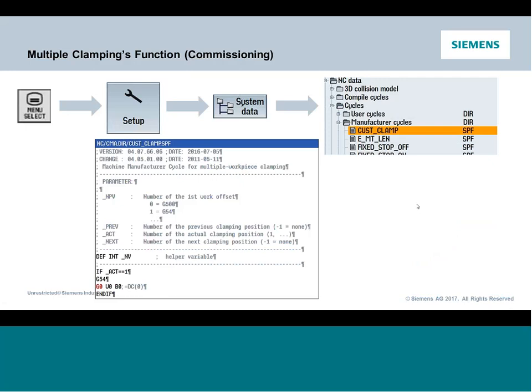See, this multi-clamp option you're seeing, this isn't just for 4-axis mill. You could use this on a 3-axis mill. In fact, that's probably where it's more commonly used. So I don't have to be rotating. I may not be rotating if there's no B-axis. If I just have 5 vices on my table, it'll methodize a part for all those 5 vices. But if I have some unique steps that I need to make sure occur during this positioning, I have to go in and add them to this clamping routine.